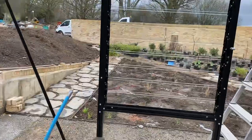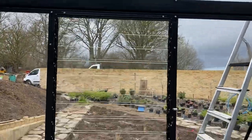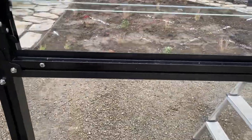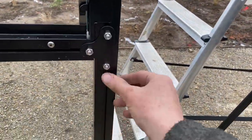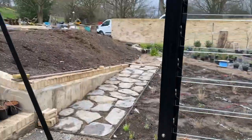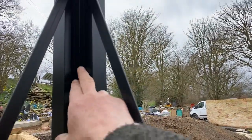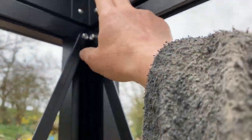Moving around to the louvre window. I put this louvre window in the centre of one side, so I can easily take out that section and put these screws in. But if you're going to put the louvre into the corner, then you really need to make sure all these screws are in place before you put this piece on top.